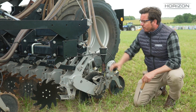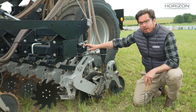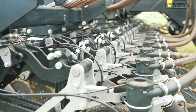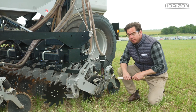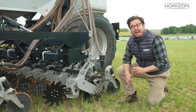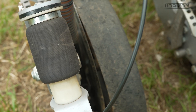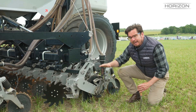The second thing I want to talk about is the coulter and the seeding part of the coulter. The coulter is on a parallelogram — every coulter has a parallelogram with 32 centimetres of travel in it. We have hydraulic downforce here; typically we can go up to about 300 kg on the hydraulic downforce, depending on how heavy the drill is divided by how many coulters we have. We can pressurise that up, and then we have the disc. The parallelogram gives us very accurate seed placement and contour following, level with the ground.